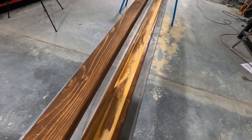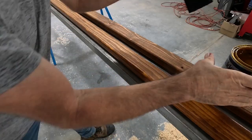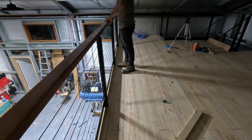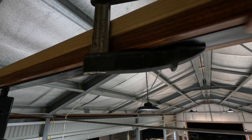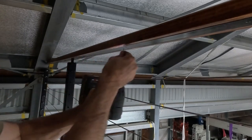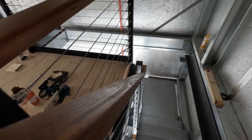There are the pieces stained — one's the underside, one's the top side. After staining I put two coats of sealer on there. The sealer is really good because it brings out the grain — you notice it here — and gives it a real nice satin finish in the end. Once that was dry I just progressively went around and fitted them all. It was a really neat fit. In some cases I just use a G-clamp to push it down with another piece of wood on top so I didn't damage anything. Once everything was in position it was just a couple of screws from the bottom — it ain't going anywhere. So there's all the balustrade wires, the handrails, the top rails — I'm super happy with that. I think they've come out perfect.